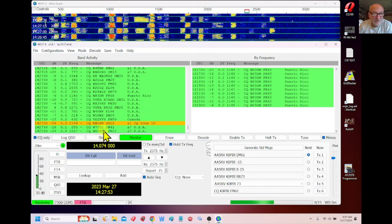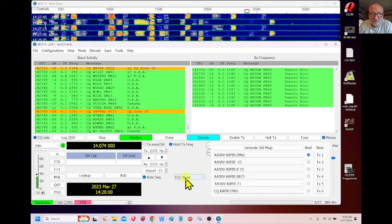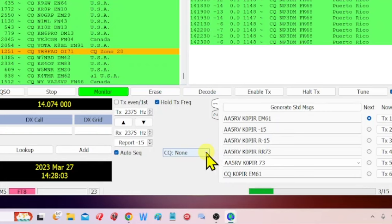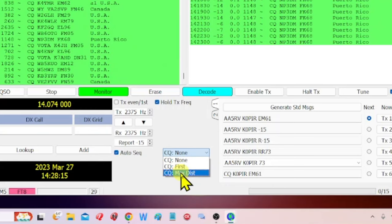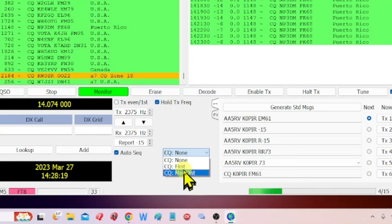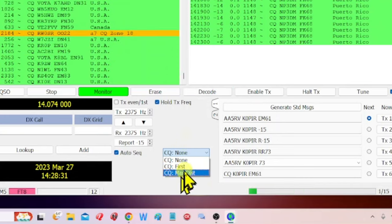I'll talk about the power output. The radio is set up and ready to go. When calling CQ, this is new in later versions of WSJTX — do I want to come back to the first one decoded, or the one at maximum distance? If you're in a contest, you'd probably choose maximum distance since some contests give more credit for stations farther away. On the ICOM 7300, push in the multi-knob at the top right and you'll see the RF power setting at the very top.